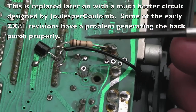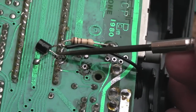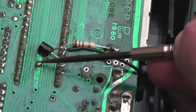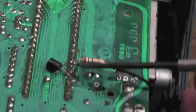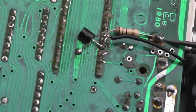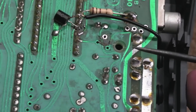This is more of a test circuit than anything - I will get some heat shrink tubing on here. What you've got here is a 2N3904 transistor. Its base, which is the middle pin, is clipped into pin 16 of the ULA. The collector is on the plus 5 volts - it's this large trace that comes down here, so I just scratched a tiny bit off and stuck the collector straight to there. The emitter, which is floating, is where your new composite video comes out. You also need to pull it to ground - the nearest ground is on the underside of the modulator. I've desoldered one of the two points where the wires were feeding the modulator, and took the centre pin that comes out of this connector. There's a resistor inside the modulator - I desoldered that and soldered the wire onto it.